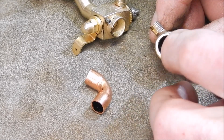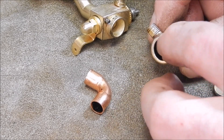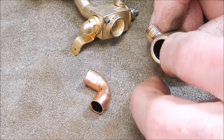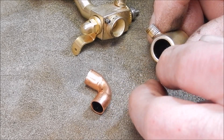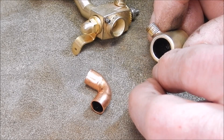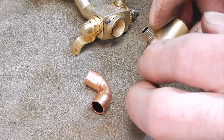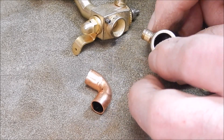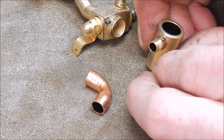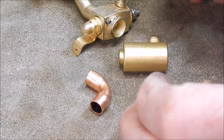So what I might do — I'll look at my BSB, British Standard Brass taps, and see if I've got one that will fit that hole, or make it fit that hole. I might tap a little thread in there, and then tap up a bit of brass rod that I can screw in there and seal it with muffler putty. And that way I don't have to heat this up. I could silver solder the plug, but then you run a risk of melting that out and getting into more trouble. So if I can tap a thread and just thread in a plug, then machine it back — it wouldn't be hard to stick that in the chuck and just bring it back level on the end.